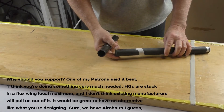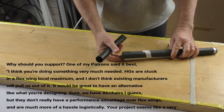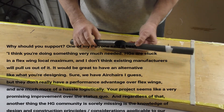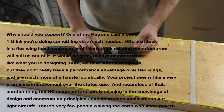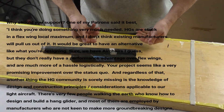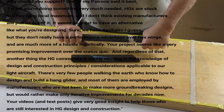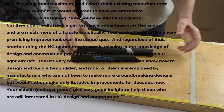As you saw from the video, it's more involved to produce the parts, but if you really need to save weight, that's a good way to do it. What I've done here is cut this tube off at an angle so I can explain why the foam has the ability to wrap on the spiral. If you took that foam and just laid it out straight on the tube and tried to wrap around, it would crack and you'd have problems matching up the edges. But doing the spiral wrap this way, when you're done you put a twist on the foam and it pulls all the edges together really tight — you're good to go.